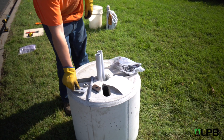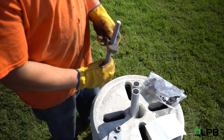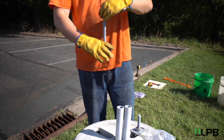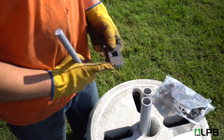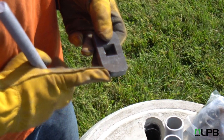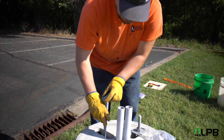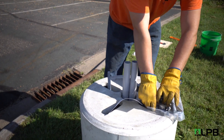Once you have chosen your hardware, open the bag and remove the contents. To begin the setup, start by placing a single anchor plate onto one of the carriage bolts and slide it down until the square hole seats onto the collar of the bolt. Note that the proper orientation of the anchor plate is with the most extreme rounded corners located on the top right and bottom left when placed onto the bolt. Next, lower the carriage bolt and the anchoring plate into the slot until it reaches the bottom, then turn the bolt 90 degrees until it locks into place.